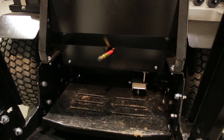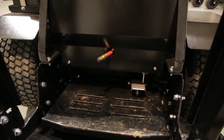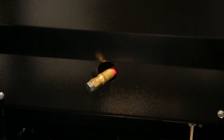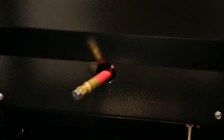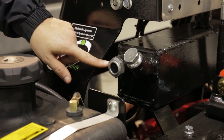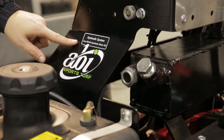The oil reservoir and dipstick are easily accessible. A full drain hose system includes a pre-cut hole out of the protective plating near the spring-loaded floor. Remove the hose from the stationary clip and place it through the hole into a drip pan to remove or replace oil. The ABI Force uses a synthetic 5W40 blend. The ABI Force hydraulic system runs on the same fluid as the engine oil — the synthetic 5W40 blend.